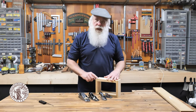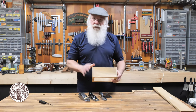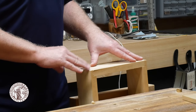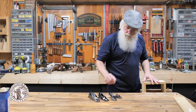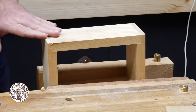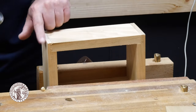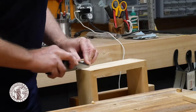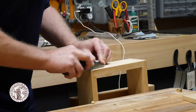Another operation you may not be familiar with is smoothing out a joint after assembly. I made this little box assembly just for the purpose of showing different ways you can use a block plane. When I assembled the box, I left the joints purposely a little proud so I could flush them out with a hand plane. When you approach a joint like this, you always want to go into the work piece and not come out from it — otherwise you'll blow out the edge of the wood.